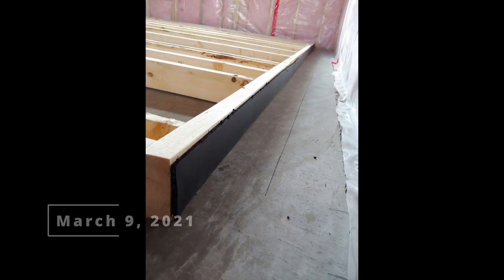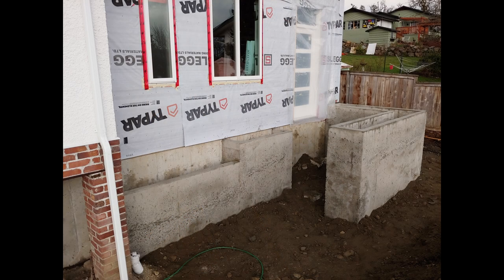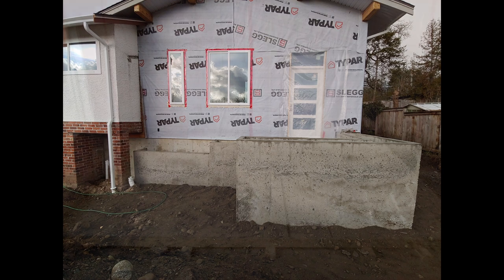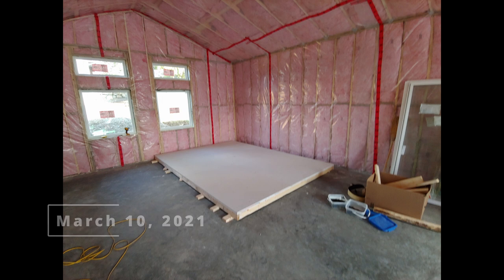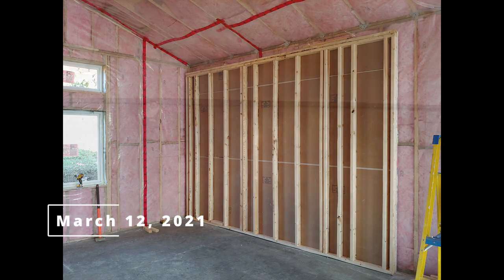The bottoms of each wall got quarter-inch rubber foam for insulation of vibrations from the floor. I'd drawn a line to show the outside of the interior wall for when we stood it up. Each wall required two layers of 5/8-inch drywall and acoustical sealant on every seam. Then four of us lifted the wall into place, and I temporarily secured it at the top and anchored it into the floor right on that line.